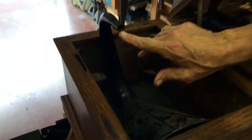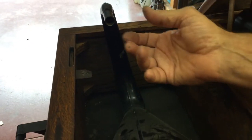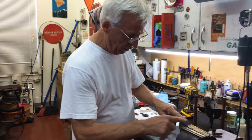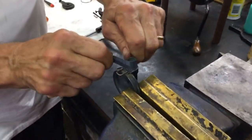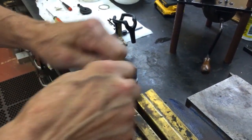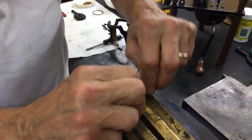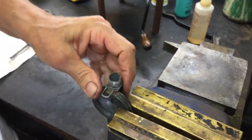The reproducer on an Amberol No. 30 fits into this hole right here. Sometimes, because the reproducers are pot metal, they swell and they stick. You can mount the body of the reproducer in the vice — I use the brass jaws — and I use thin sandpaper like this, and I sand this way, then I move to 12 o'clock, then over to 3 to 9, and then around to 3.